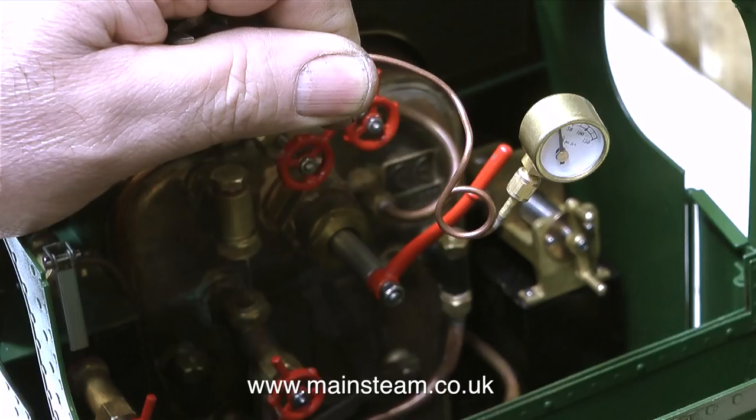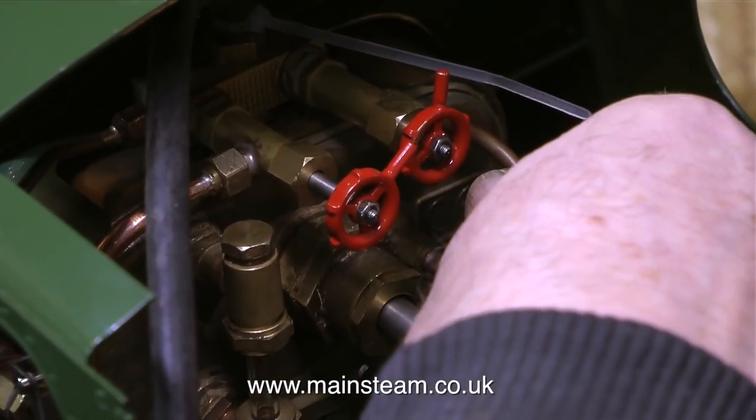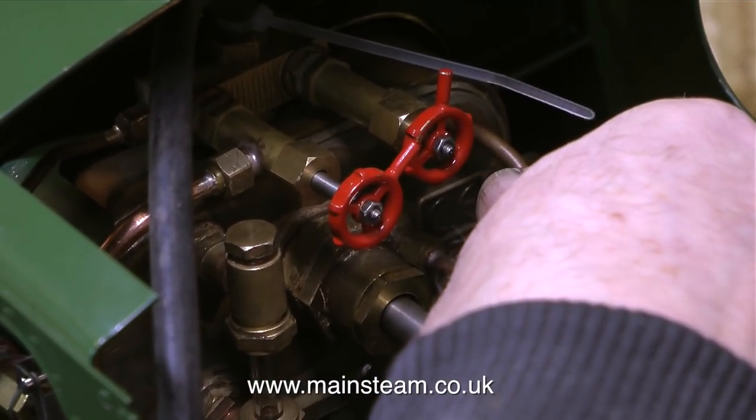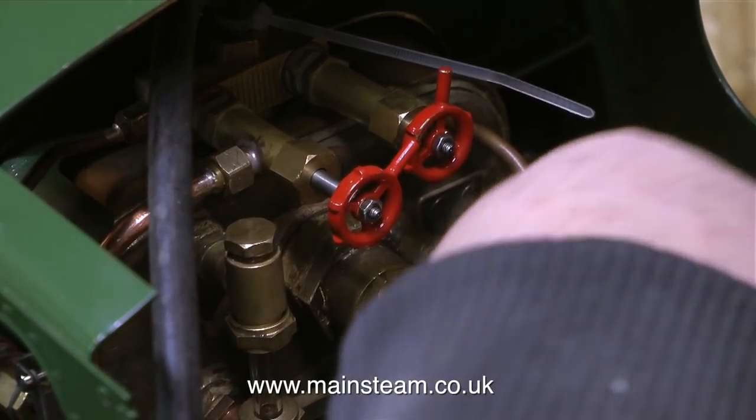It's minor things like the thickness of the pipe that supports the pressure gauge - it's too long, a bit thin and feeble, and would allow the pressure gauge to vibrate when the engine was running. So I removed it and I'm using a piece of silicone rubber pipe and a nylon tie wrap on the junction where the pressure gauge was mounted to put some compressed air into the boiler.